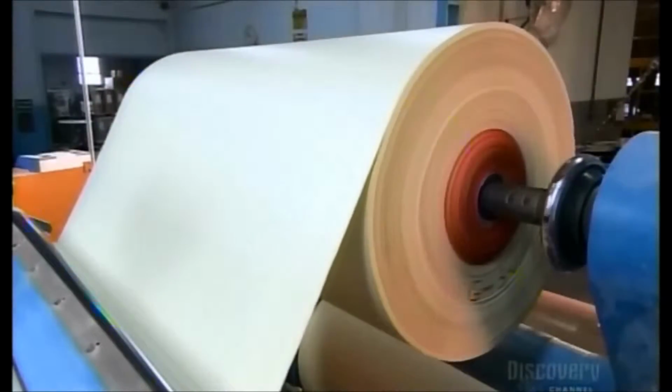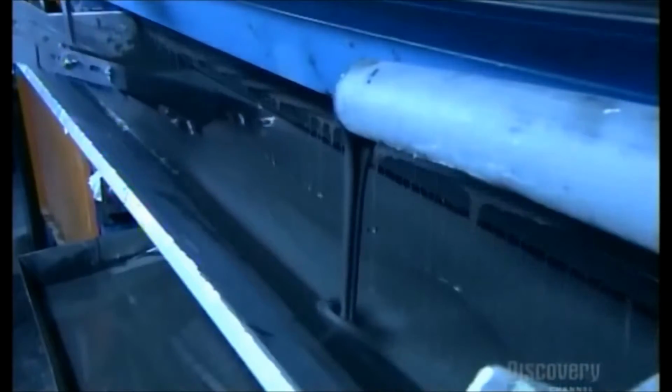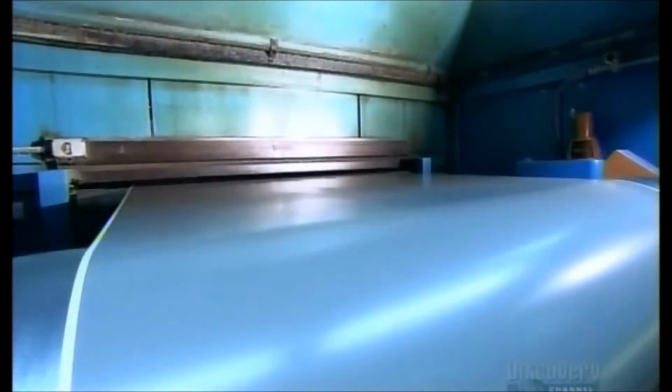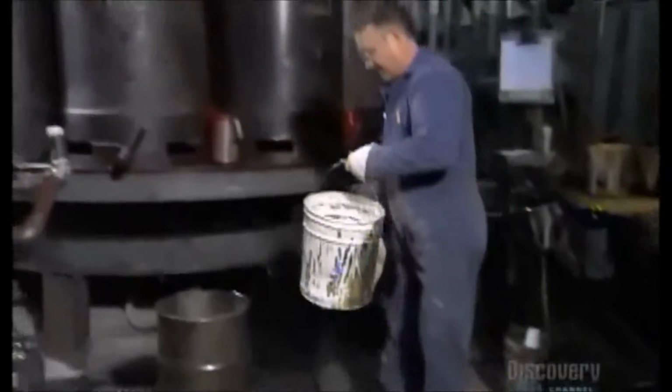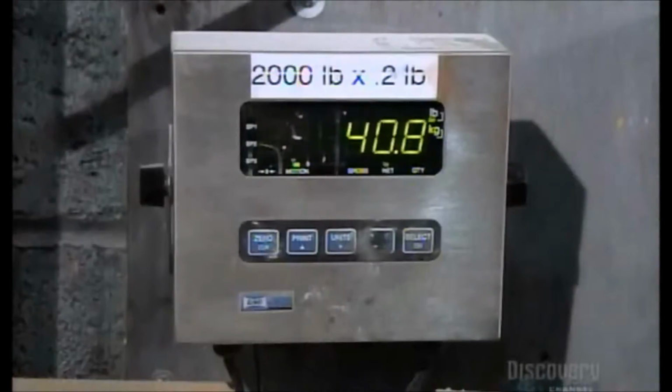Now, a big roll of paper with a leather-like texture to it unwinds into the coating machine. As tinted liquid vinyl flows into the machine, a mixing arm agitates the batch, and rollers below apply it to the paper. The vinyl-coated paper then travels through an oven, and the vinyl hardens, taking on the paper's texture. That first layer is only a thin one to establish the surface grain.